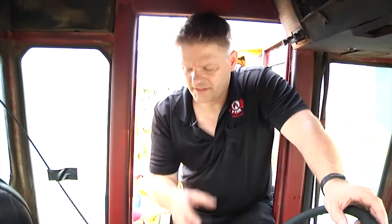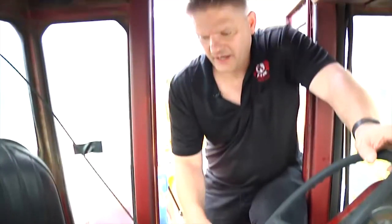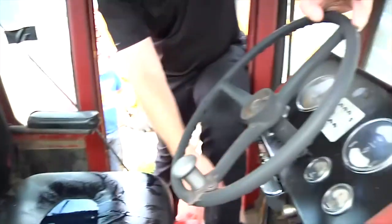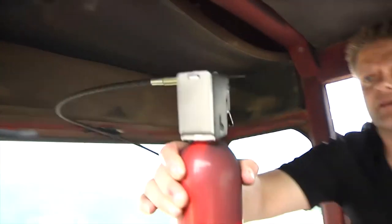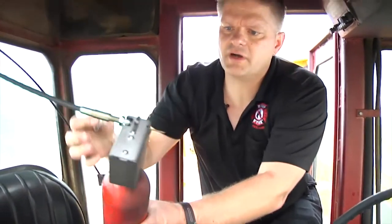There is more damage from the soot from the fire than from anything else. Here's a great example of how effective it is — you've got a whole puddle of diesel fuel right here, unburned. Obviously it was so hot inside this cab — look, this all melted away. You've got a whole cab filled with flammables, and stop-fire put it out and kept it out. That's again why you want to let it cool down before giving it fresh oxygen. Here's what the unit looks like all done — fusible link broke, extinguisher went off. Simple.